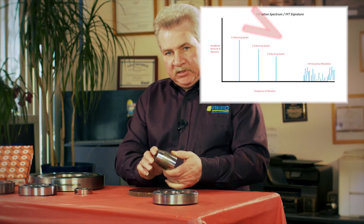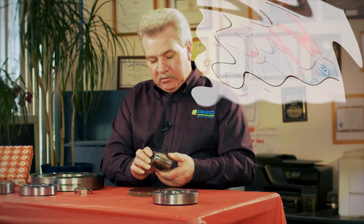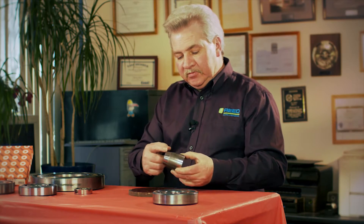If you were using a bearing analyzer, you would see a floor trash level way out in the middle of the spectrum if you were somewhere around 1500 Hz. You can see all the shaft current problems showing up.